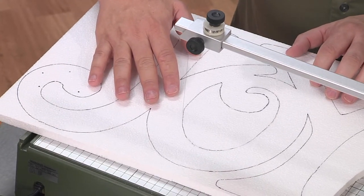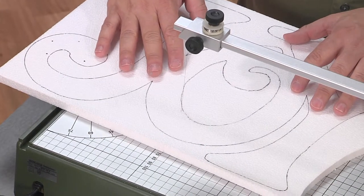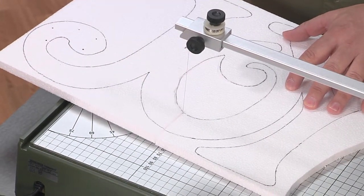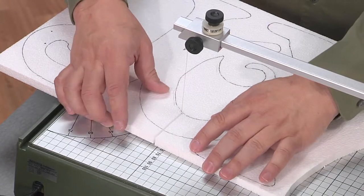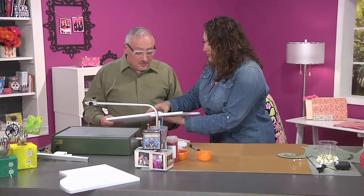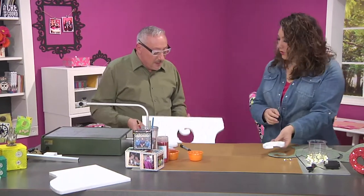We cut through, and you said to make sure we stop and don't try to cut back through the same cut, because it's such a small, precise cut, you'll never get to the same place. I'm going to turn the machine off, and you can wait just about two seconds and this wire is cool. So now we can actually spread it apart and take it right out. That center just pops right out — really cool, totally precise.